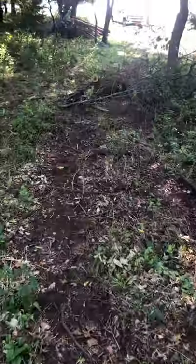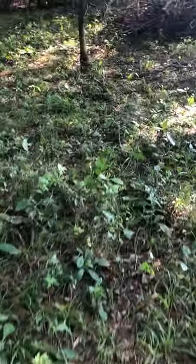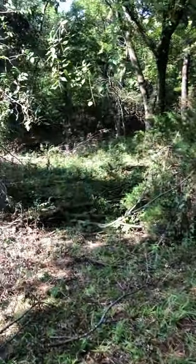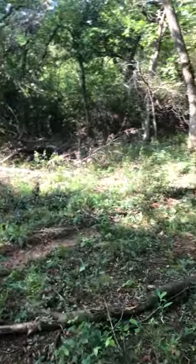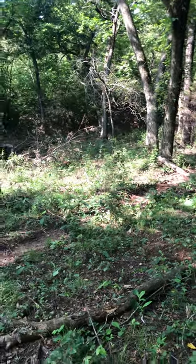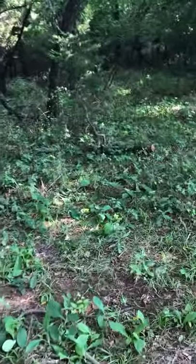You want to sever that wood before it moves anything. It's really key to keep the integrity of the wood - no wind shake, fiber tear, or splitting of the log. Falling a tree improperly can cause micro fiber cracks throughout the log, and when you slice it into boards they'll just pop apart. Doing things right is really important.